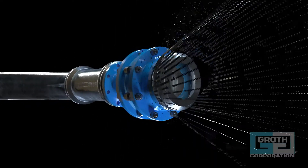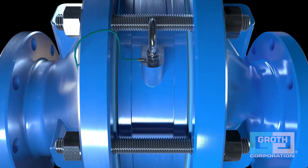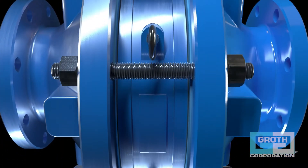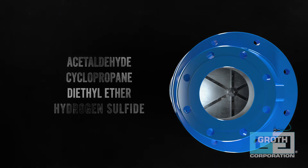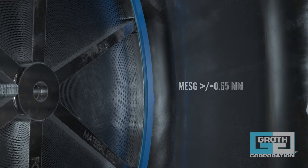The 77EAF is a flame arrester that reliably prevents flame propagation and delivers the highest pre-ignition pressures while also providing industry-leading flow rates at the maximum allowable run-up lengths. Its applications include acetaldehyde, cyclopropane, diethyl ether, hydrogen sulfide, and other gases with MESG greater than or equal to 0.65 millimeters.